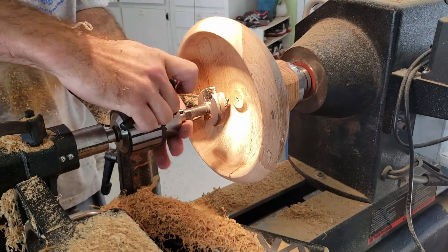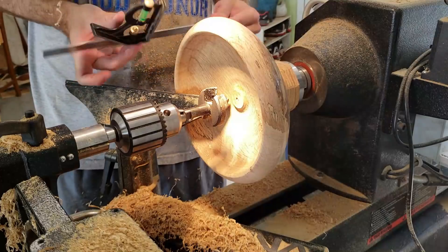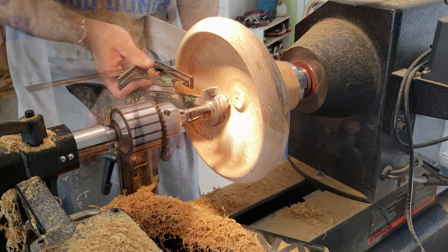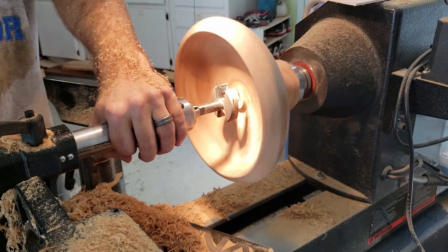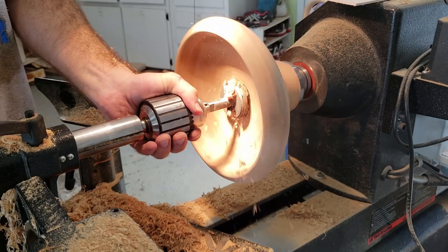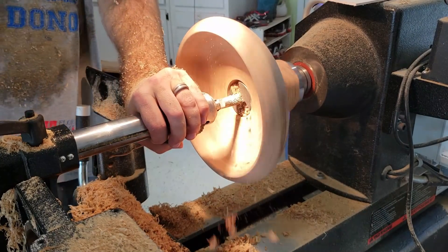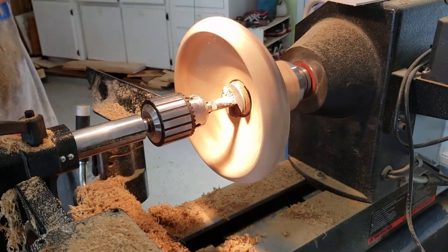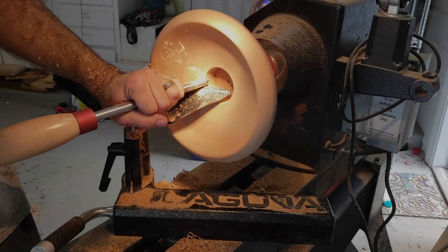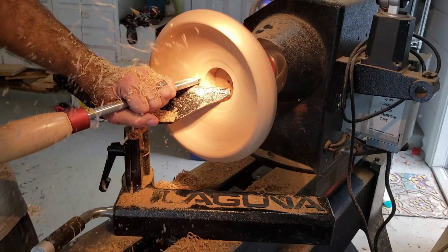After that, I ended up giving up on the corer for this bowl — I just wanted to get it finished. I hold up a piece of thin stock where the bottom of the bowl is glued to the waste block, and use that as a reference edge for my square to determine the depth of the bowl. I know the rough wall thickness I'm shooting for, so I adjust the square down by that amount, reverse the square direction to reference the tip of the Forstner bit, and eyeball the spot where the square ends. As I'm drilling, I close one eye to reduce parallax, and when that spot on the bit is reached by the top rim of the bowl, I know when to stop drilling. It doesn't have to be exact, but it's definitely better to err on the side of caution and not drill too deep.